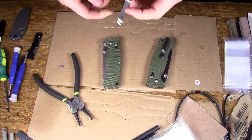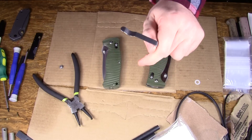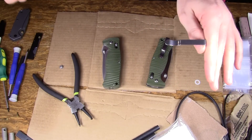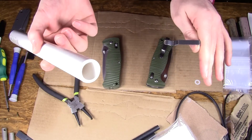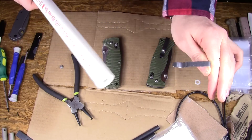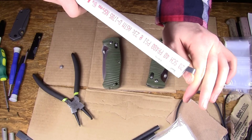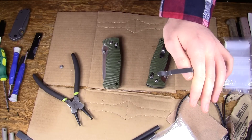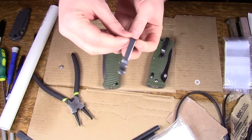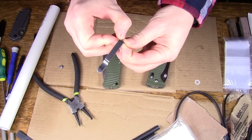Here's how you do that quite easily. It's best if you have a vise — just pretend my fingers are a vise. You clamp it like this and you'll probably want to grab yourself a little bit of pipe or something to slip on there to make a lever, then just pull. Do it very gently, very slowly. With a long handle like this you'll be able to exert a lot of force on a fairly small piece of sheet metal, so you don't want to kink it or bend it over. When it switches from being bent a little bit that way to a little bit that way, you're done.